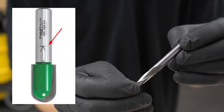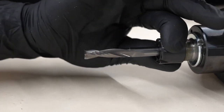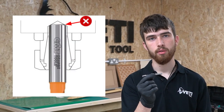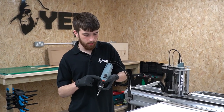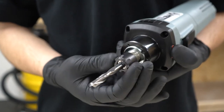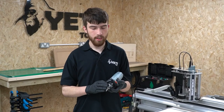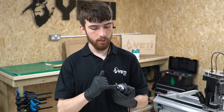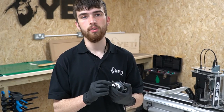Some tools will have what we call a K mark etched on the shank. The intention of this mark is that it should be lined up with the front face of the collet as a guide of how far to insert the tool. However, it is just a guide — always prioritize the two rules: the tool should always be inserted a minimum two-thirds of the way into the collet, and the tool should never touch the spindle taper. To tighten the tool in the collet, press the rotary stop button on the spindle, tighten the nut by hand and then add one eighth of a turn with the spanner. This equates to around 10 Newton metres, which you should never exceed as this can cause the collet to twist and increase your total runout. As a final check, look at the gaps in the front face of the collet — if the gaps are open and even, this ensures that the collet is the correct size and has not been twisted by over-tightening.